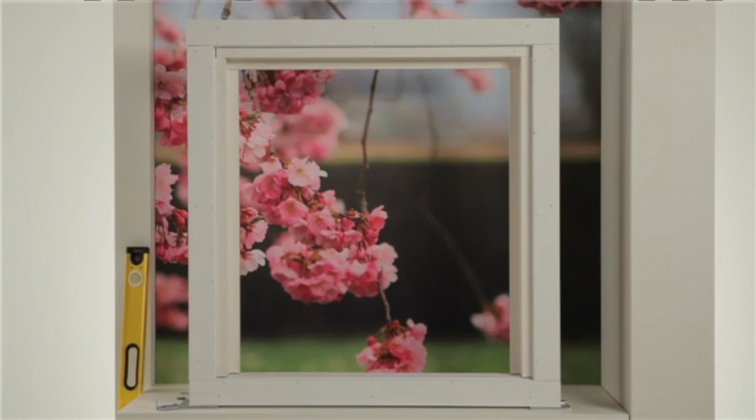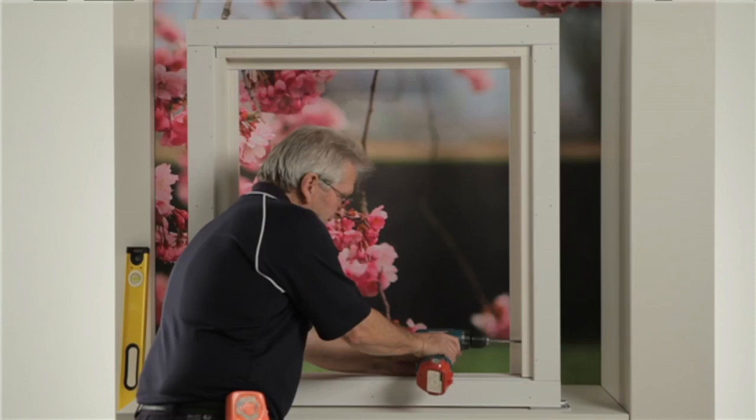For recess or face mount, drill a 3/8 inch hole through the first layer of the side of the frame within the mounting area every 250mm, starting at each end of the frame.